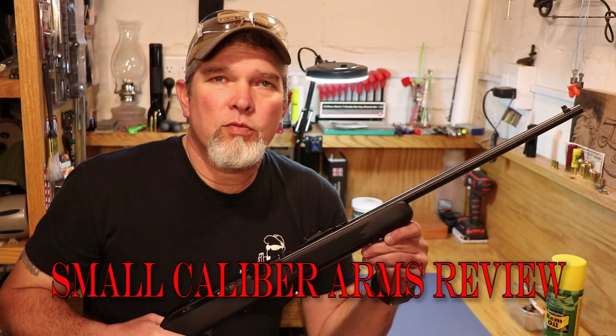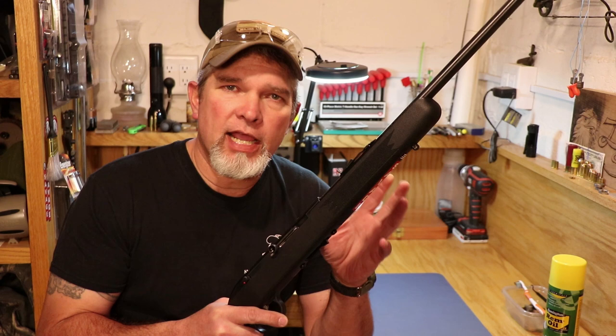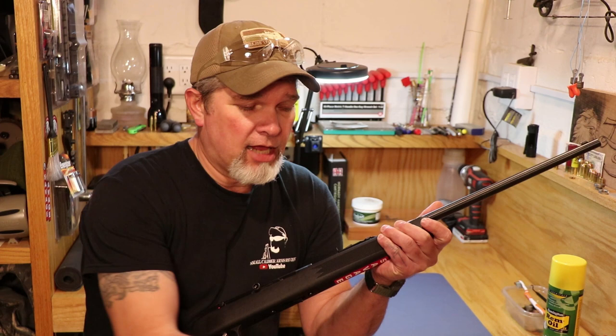Today we're going to be taking apart the Savage Model 62F, the little 22 semi-auto, and going to give it a good cleaning, and I'll show you how this thing comes apart. You're going to need a couple tools, probably a couple Allen wrenches, 5/32, and depending on when yours was made, you may need either a screwdriver or a quarter inch Allen wrench also. Let's get this thing taken apart, see how it works, and get it cleaned up.